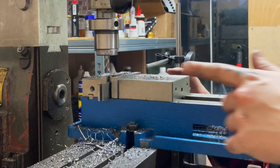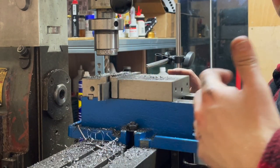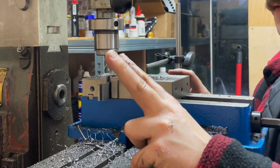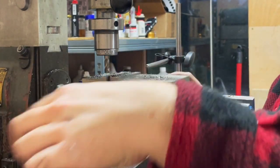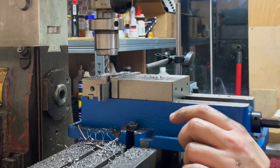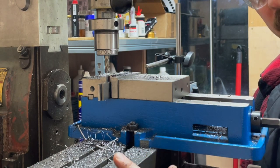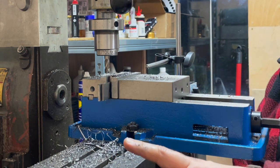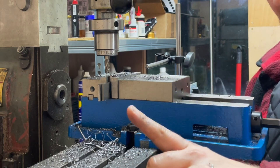Wheeling the table back and forth when I'm measuring there is a bit of wobble, but that's really because the table is at maximum extension and it's just not very stable there. I am missing two grub screws for the dovetail gibs — one for this axis and one for fore and aft. If anyone has any ideas on what thread they are or where to get them, please let me know. I think what I might end up doing is just replace all of them because they're all a bit knackered.